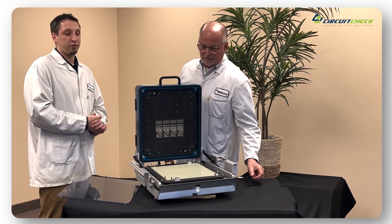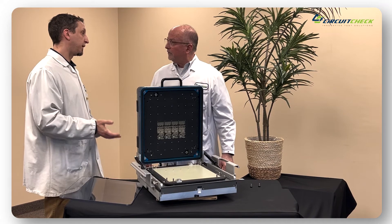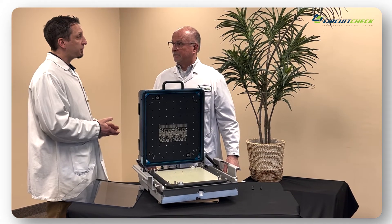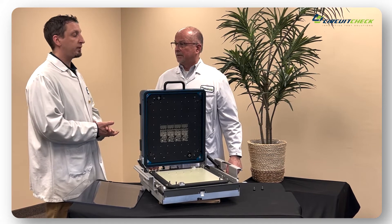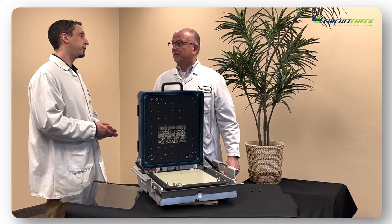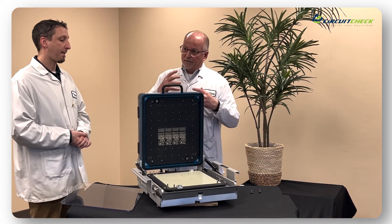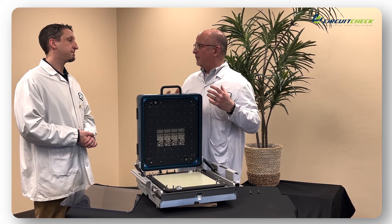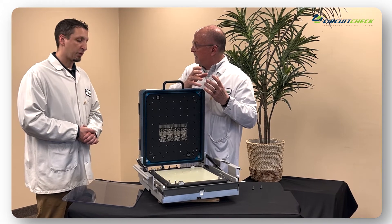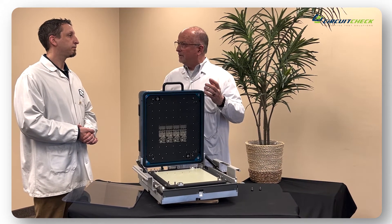And what's also a little hidden feature in this is that we've actually increased the topside travel of this vacuum box. Really? Before we were sitting around a quarter inch of travel, where now the new Vortex introduces almost three quarters of an inch of travel, allowing for less radial motion issues and less risk of damage to the circuit. So that reduced amount of radial motion allows us to put board supports and pushdowns closer to the components? Correct. And that's going to reduce possible strain issues? Sure will.